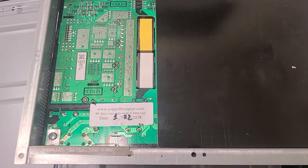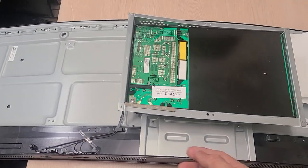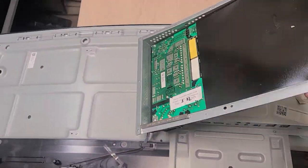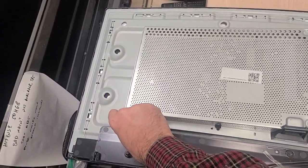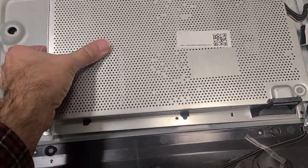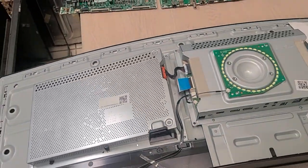This is the label on the power supply board. When it came in it was totally dead, and the easiest tell was the fuse here on the back of the board was actually open. Don't replace the fuse — I've made a number of videos showing that this is not the solution. This will only result in another fuse being blown.